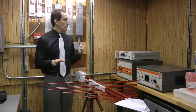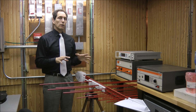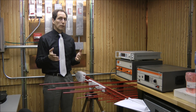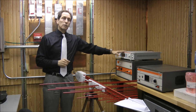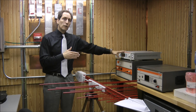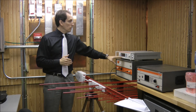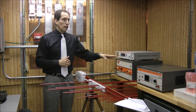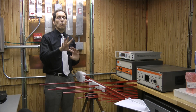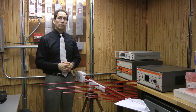Let's talk about the transmit side. You have to have some way of generating an RF wave to transmit towards the shielded enclosure so that you can measure its level. You need a signal generator that's pretty broadband — from about 100 kHz all the way up to 1 GHz — a broadband high power amplifier, and a broadband antenna. These three combined with the spectrum analyzer give you the whole system needed to measure shielding effectiveness.